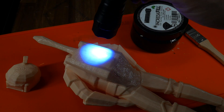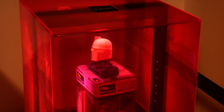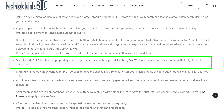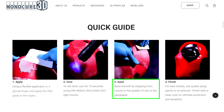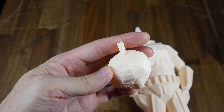When you do want to cure it, the provided UV torch definitely does a good job. However, it's a little bit slow for my patience level, but that's largely irrelevant because you could also use a UV curing chamber intended for resin-printed parts, or simply utilise the UV light that comes from the sun. I did notice after curing that the surface was still tacky, and that's because it still needs to be wiped with IPA to address this. Once you get to sanding, Incredifil is soft enough to use with regular sandpaper, but firm enough to use a file or a blade if necessary. And unlike wood putty, you can wet-sand Incredifil without it breaking apart. Ultimately, Incredifil passes my test because it works as advertised.